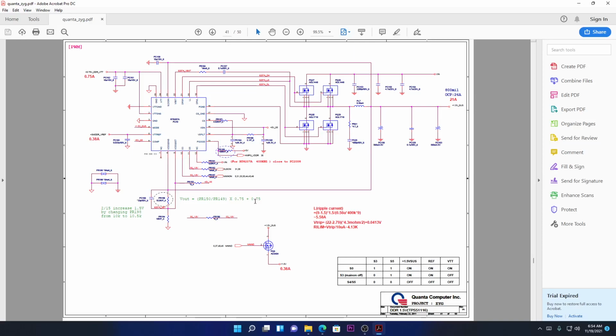For DDR3, why am I saying DDR3? I can see here by voltage, 1.5 volts. 1.5 volts is for DDR3, and 1.35 volts is for DDR3L, low voltage, and 1.8 volts is for DDR2. Guys, you should be able to tell just by reading the voltage, and on the RAM connector they normally write whether the RAM is DDR3, 1.5 volts, 1.35 volts. They do specify it on top of the RAM connector, the black connector there, you will see.